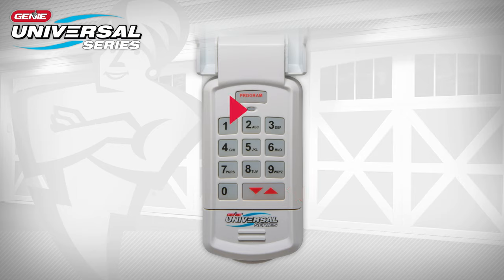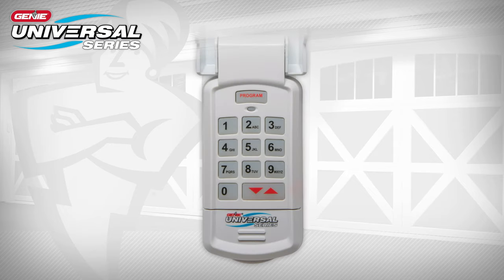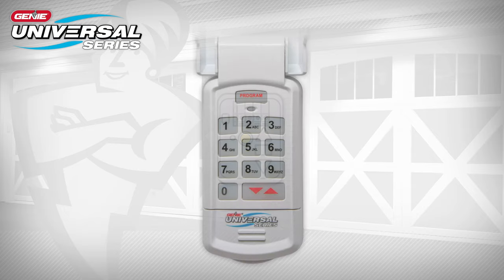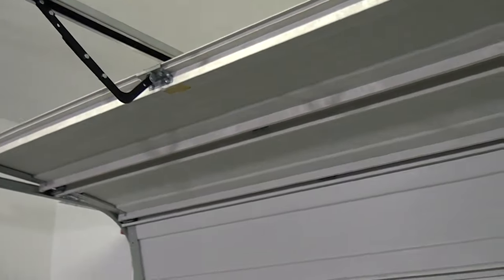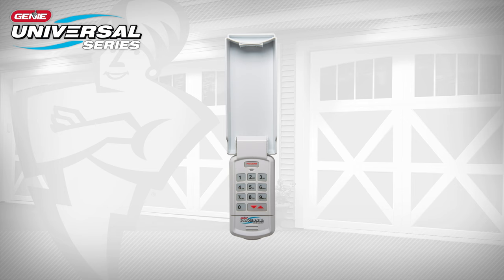With the keypad LEDs still flashing, press the Learn Program button on the opener for 2 to 3 seconds, and then release. On the keypad, press and release the up-down key once. The opener will click. On the opener, again press the Learn Program button for 2 to 3 seconds, and then release. On the keypad, again press and release the up-down key once. The opener will click again. Press and release the up-down key again, and the door should move. Programming of opener 1 is complete.